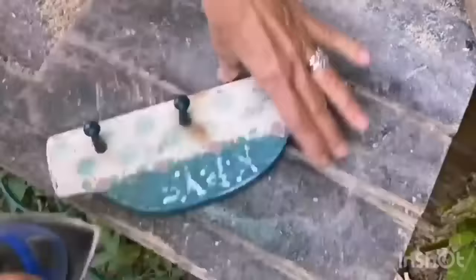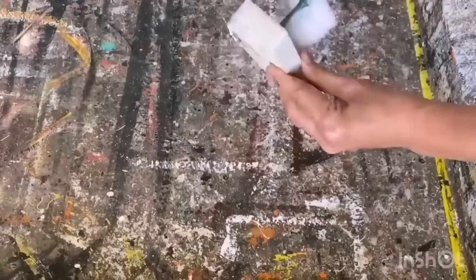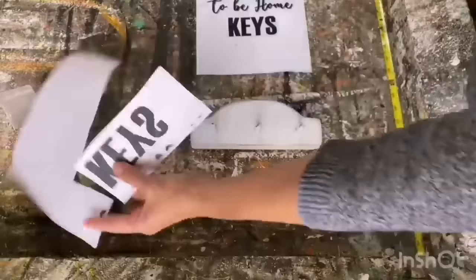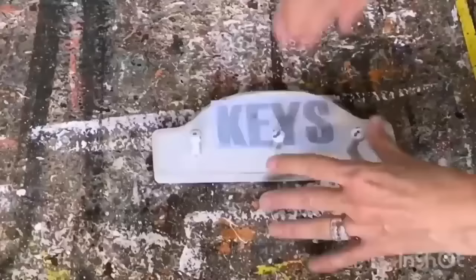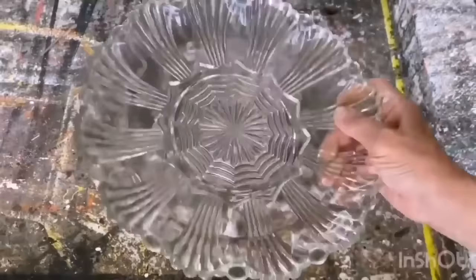This tool painted key holder had a few knots that were leaching through the wood and the paint, so I sanded it all down and wanted to seal it with some primer — otherwise those knots would just keep coming through. Once the primer was dry I took my white chalk paint, gave it a coat of paint, took it outside and gave it a sanding. Then I'm doing again my Mod Podge reverse graphics — I printed off the word 'keys,' I thought that was nice and simple and would work great for this little key rack. Put on the Mod Podge, pressed all the bubbles and wrinkles out, set it aside for 24 hours, and then the next day rubbed off the paper — here's the end result.